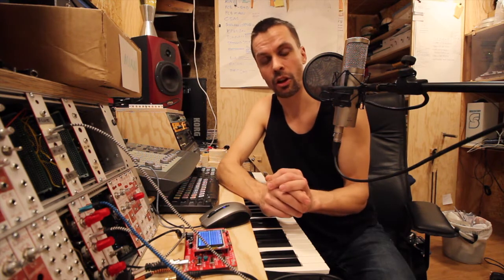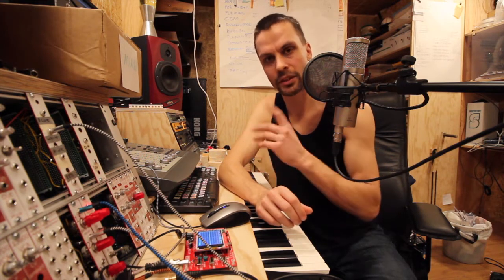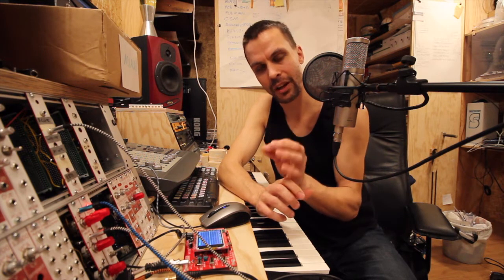So we're going to make a digital noise module from the A4006, used in the TR-909 amongst many other old vintage products. It's not truly random, technically, because it is just pseudo-random. At low frequencies it does sound random, but if you speed it up really fast you will hear a pattern.